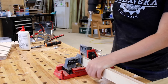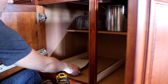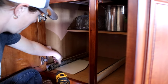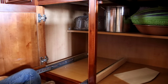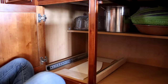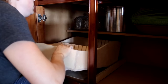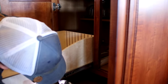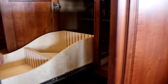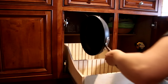Just look at your setup to see what will work. Once the runners are in, I placed a scrap on the cabinet's bottom to create a standoff for the sliders, then attached those two together. I placed a few more spacers on the bottom of the cabinet before setting in the drawer. This allowed me to pull out the slides and connect them to the drawer with it in position — I attach the front two, then take out the drawer to attach the far back location.